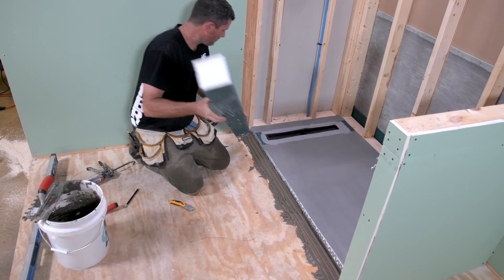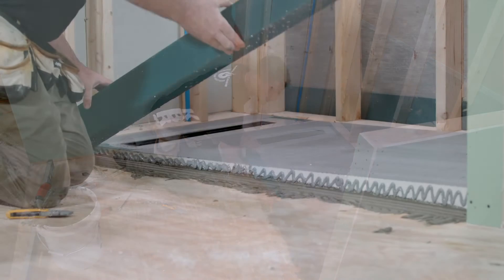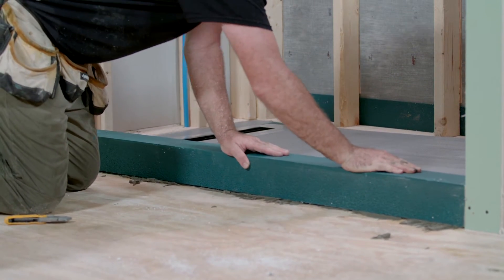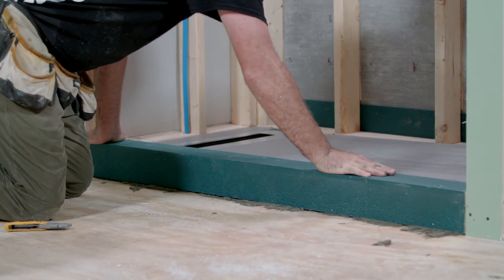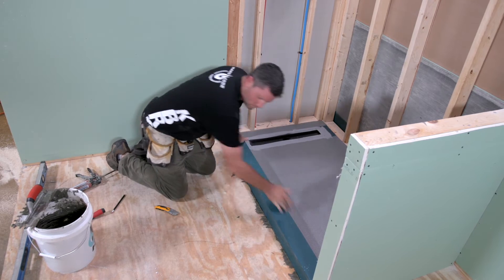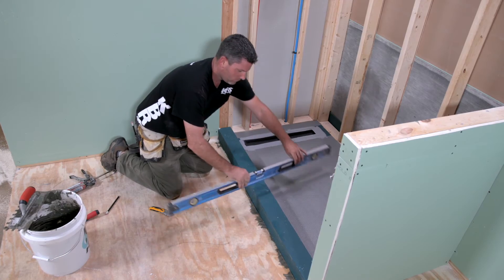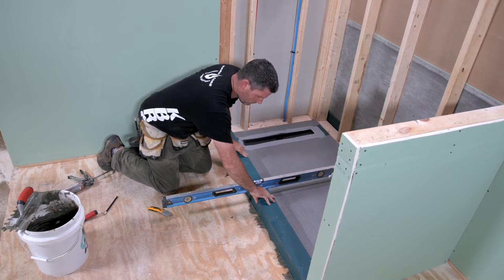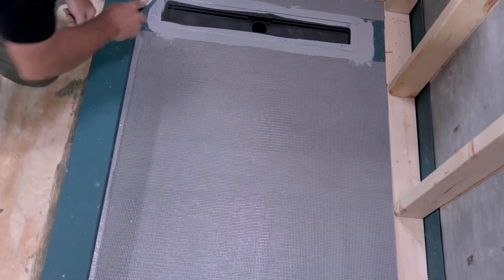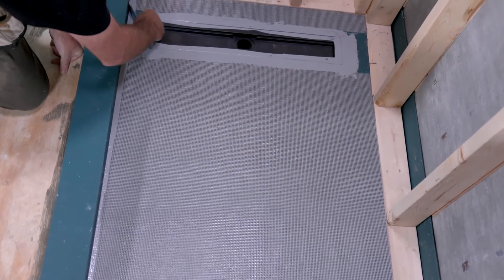When joining curbs, you must apply sealant to one of the ends where the curbs will abut up to one another. Place the curb on top of the thinset and firmly press the curb against the edge of the shower slope, allowing sealant to squeeze out. Firmly push down on the curb, embedding it into the thinset. Using a level, be sure that the curb is level along its length, yet be sure the top of the curb is sloped towards the shower area. Using your finger or a putty knife, tool additional sealant into any joints where the curbs join and where the curb joins the linear shower slope.